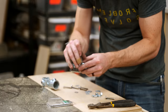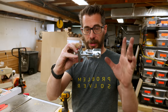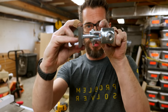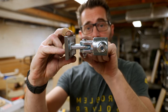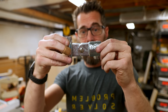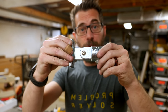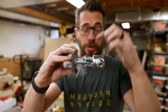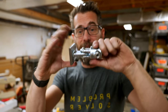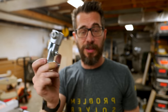Got this thing figured out, and it took a minute because this piece right here is tapered — wider out here and then as it goes towards the center it gets a little bit smaller. I was trying to push the washers in around this piece at the wider section instead of at the thinner section. The way I ended up doing it is putting the washers on this direction and pushing the whole thing together with a little extra tooling — a screwdriver going through the hole. I was able to get everything centered, then drove in a screw, put on a nut, and now we have zero slop. It is very, very tight. So this totally works — I just have to do it seven more times.